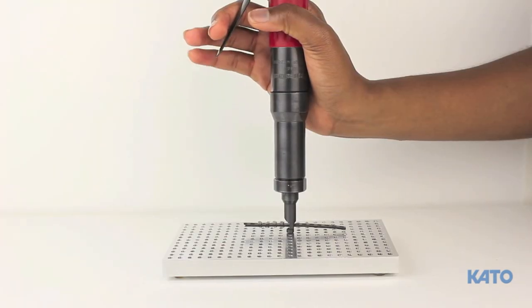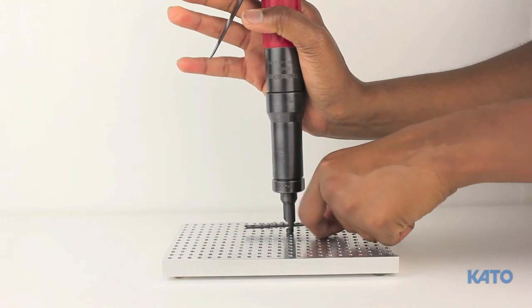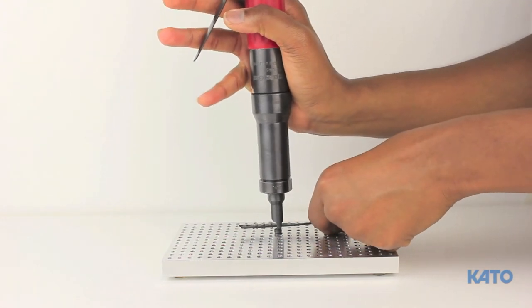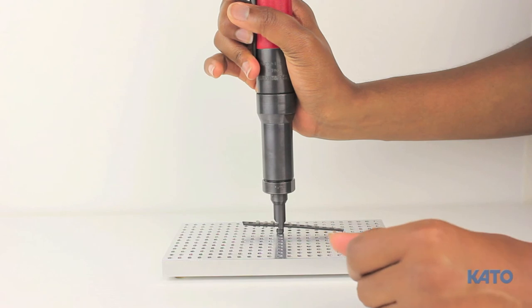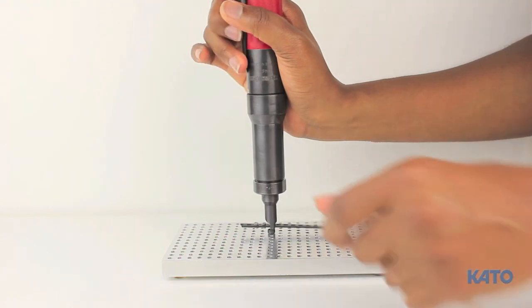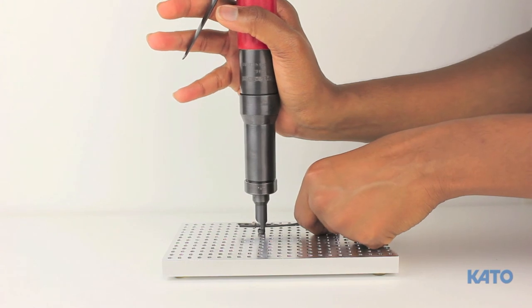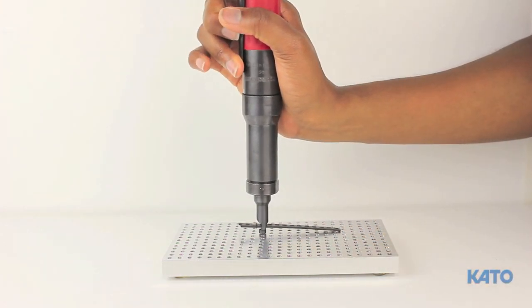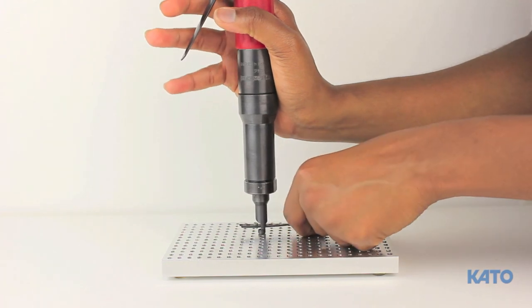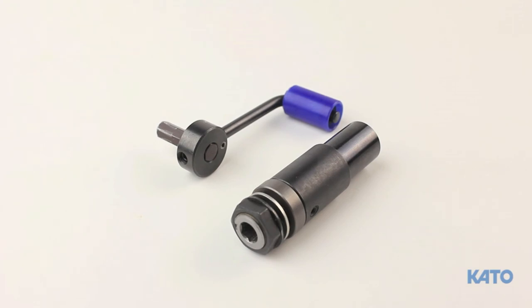With the air tool completely assembled, we'll install some inserts. When you feel or hear the clicking sound, that's your indication that the insert is installed and to release the lever. As you can see, it only takes a few minutes to initially set up the clutch drive. Once you do, it's easy to assemble into the air tool and easy to use. The air tool can be very powerful — that's why the clutch drive is required when installing 256, 440, M2.5, and M3 tangless inserts. The clutch drive was designed to protect the smaller mandrels from breaking prematurely and to prolong the life of the installation tool. Thank you for watching the Kato clutch drive video.